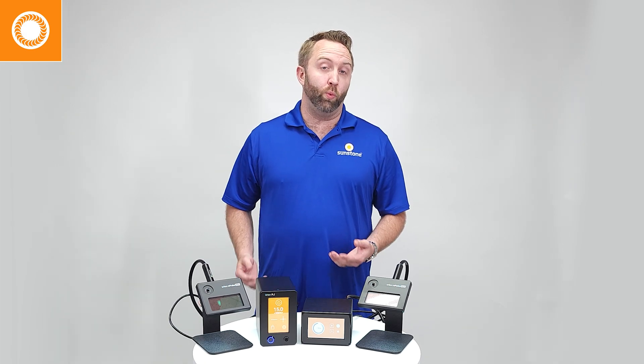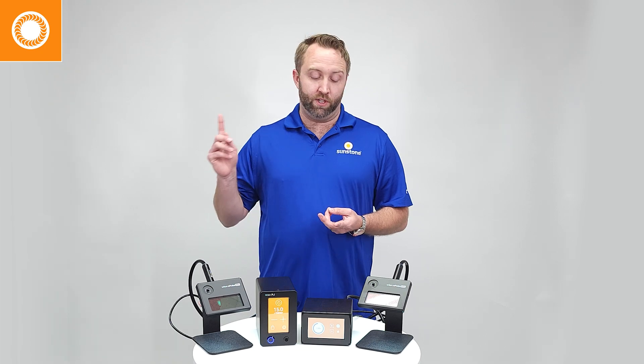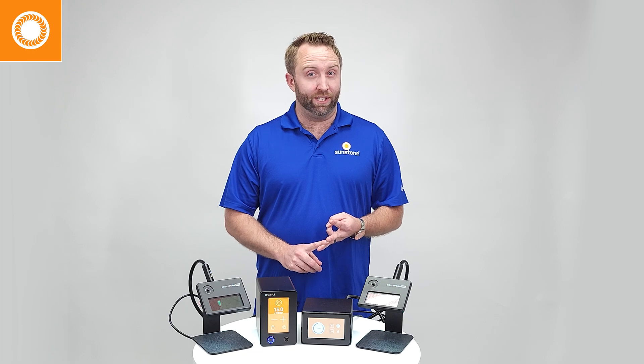However, you'll find that if you do use argon, your weld will be cleaner, your electrode will last longer, the result will be easier to get and maintain, and overall the experience will be a better welding experience.